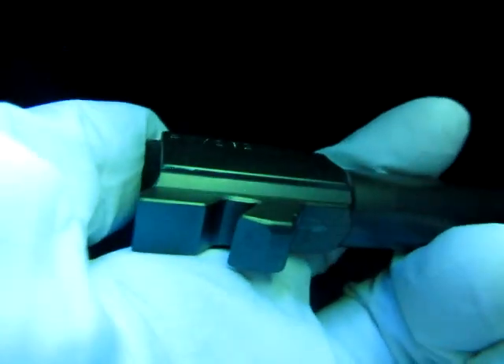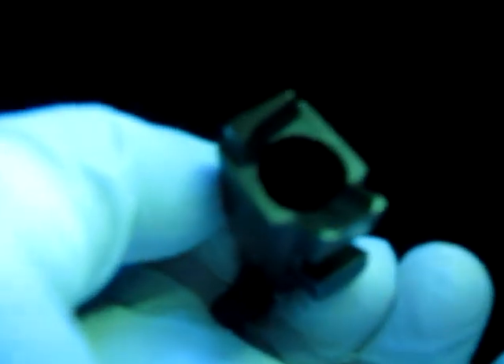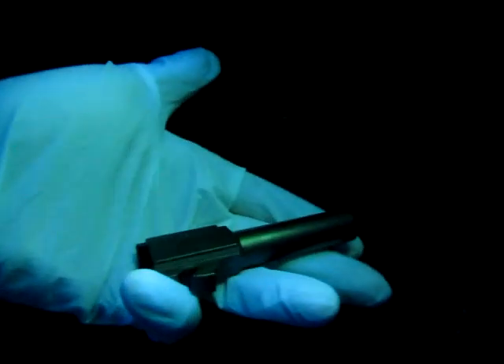I think that's because there's a little bit of lettering or something inside, but it's nothing to be concerned about. I'm more concerned about the side walls, which I don't see any indication on. There is a slight indication right about here but it does not go all the way through the barrel wall. I'm going to put it in the developer for 10 minutes and make an official judgment on structural integrity.